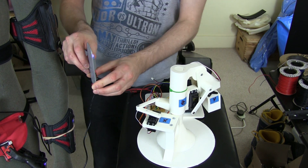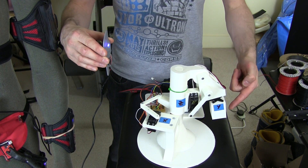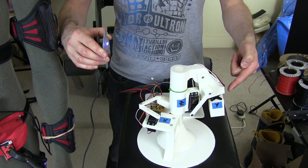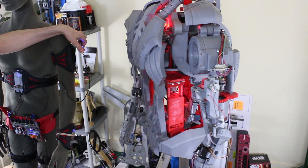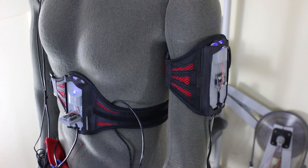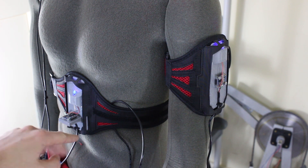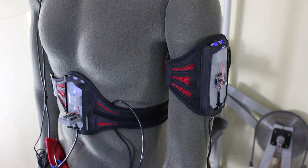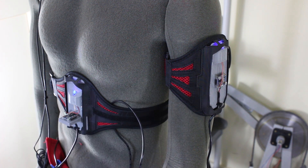In part three, I had that sensor oriented so it's flat when the arm is out. So I need to move that sensor back on the motion capture suit. This is why I had trouble getting the arm control to work — I had to twist it as well to get the motion I wanted and it wasn't very satisfactory. So what I've done is moved the arm sensors so they're flat, while leaving the body, legs, and head level. Check out part three to find out why things are so weird — this is basically how the robot is designed for the sensors to work in this orientation.